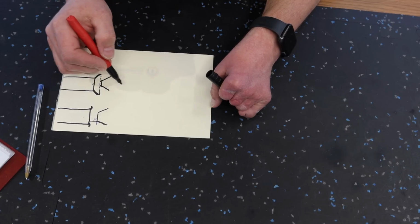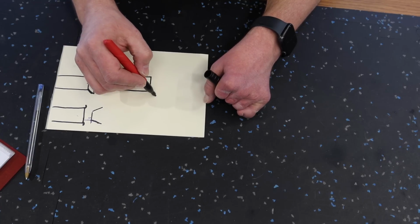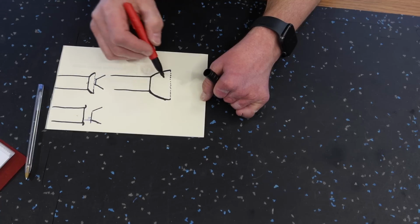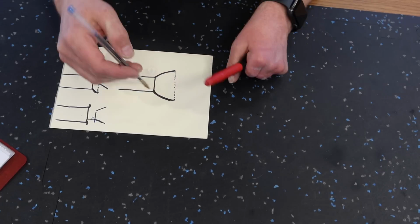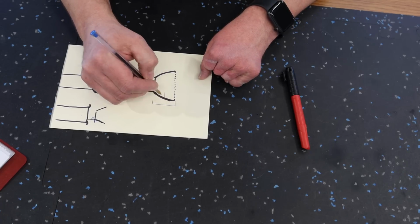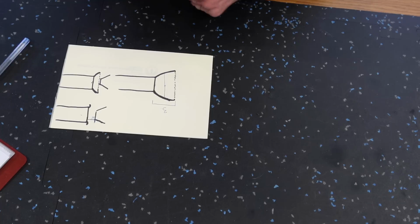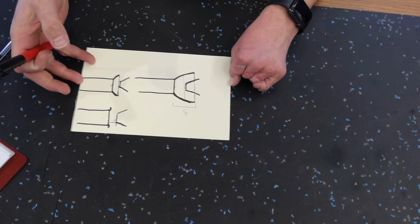Now in a scenario like we have in this plane and many other planes, you've got a pipe, and you've got a large bell mouth, like this. So what you want to do in this case is split the difference. A good resource for this would be the Gromania pipe website. They've got a nice layout here. So you kind of want to go 50-50. So if this large bell mouth is 3 inches, you're going to want to go 1.5 from this point to the mid, 1.5 from this point to the mid, and that's where your turbine exhaust cone wants to go. Okay, so that's kind of the 3 different layouts that you'll find in most turbines.